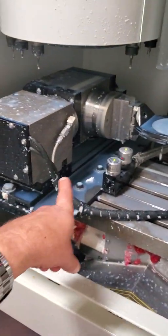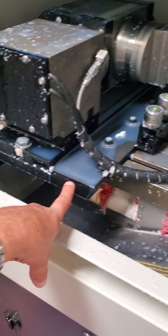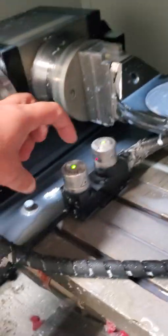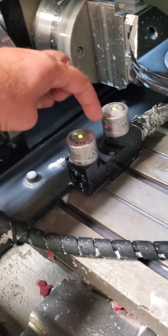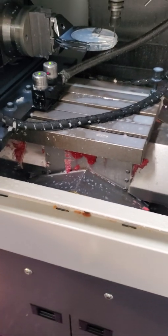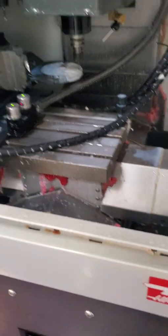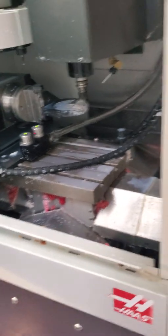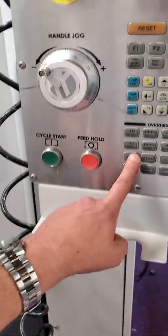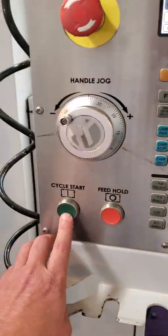I made this, turned that rotary unit sideways, mounted it with, we made that in our city, Richmond, and the fixture, the vises from Germany, an adapter plate. I added in a Renishaw laser tool measurement system, no contact. And this machine has a 1 micron mechanical software resolution and closed loop encoders on all axes. And so clockwise, coolant, cycle start, keeps going. An employee's going to measure that, and he's probably calibrating like Z-axis or something.